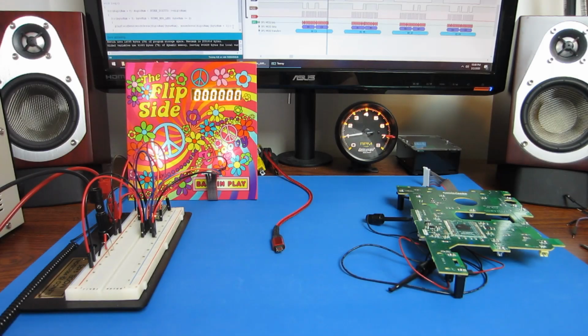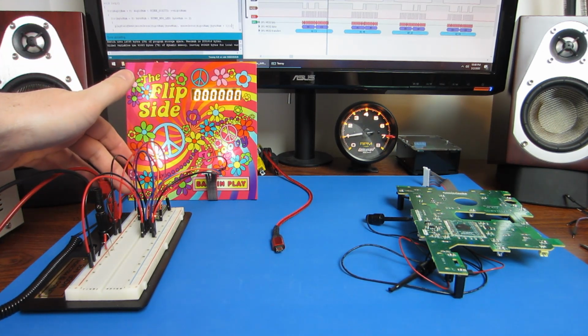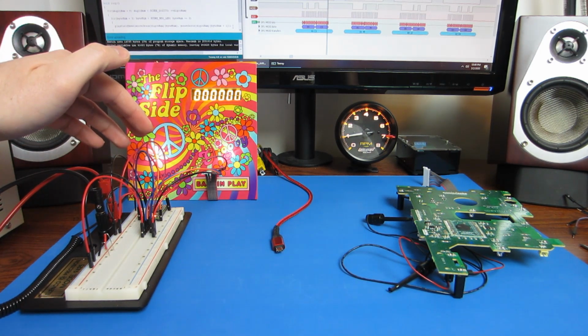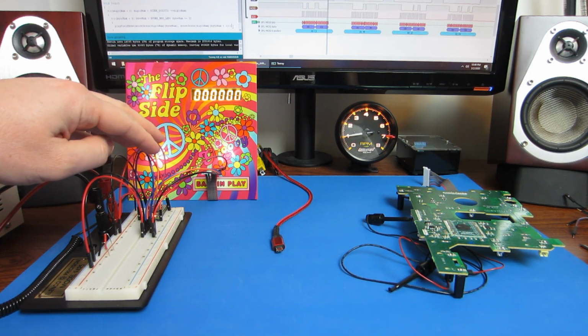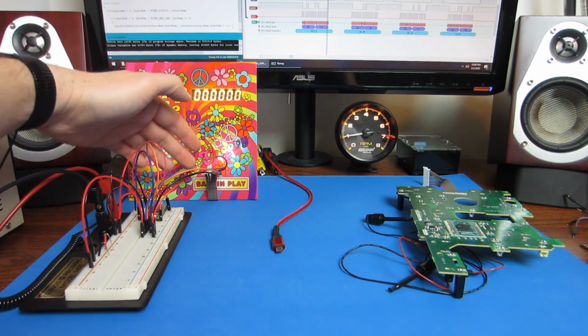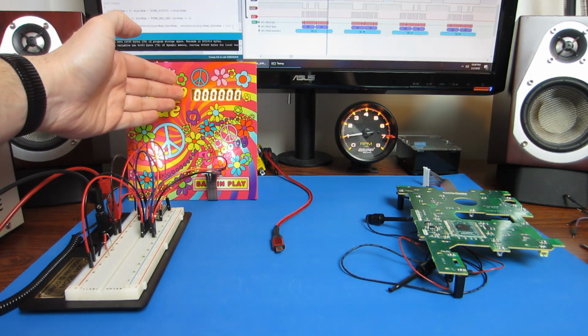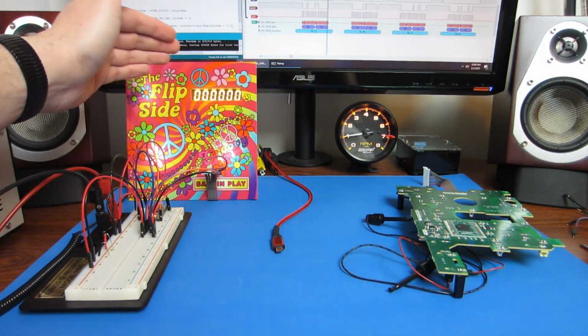And it works. Check this out. I've got my Teensy powered by my power supply. What used to be the SPI lines are now my own personal shift functions, but they're shifting to the ribbon cable to the backbox and displaying all zeros. And those aren't all zeros from the playfield. Those are all zeros from my microcontroller.